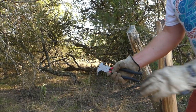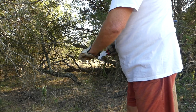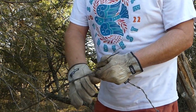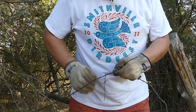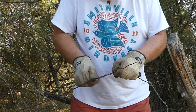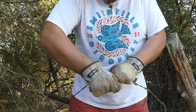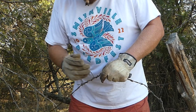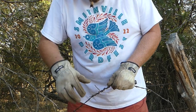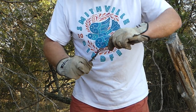So I did find the other end. Let me go ahead and splice a piece in here and then stretch it. It's about a three-foot section missing out of it. So I'll do it against my shirt so you can see. I'm wrapping it one way all the way, and I just leave the ends like a piece of barbed wire — don't bother trimming them — just leave them up a little bit, and then wrap the other piece against it the opposite way. That braids just like a braided rope when you splice rope together. This braids the barbed wire together so that the load, when I stretch it, is spread out over the entire volume.